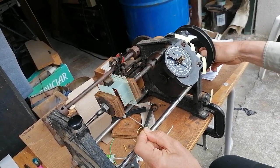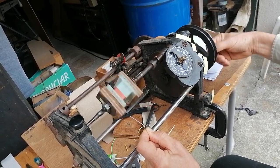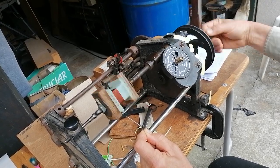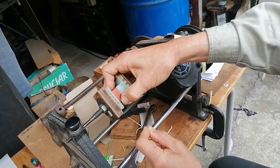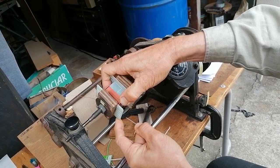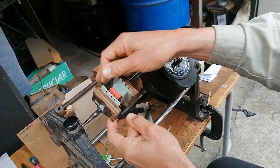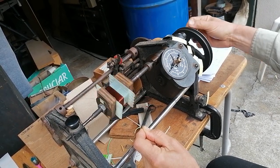The idea is to roll it so that there's no wires crossing over each other and that the windings are nice and neat, tightly fitting snugly against each other. It's easy to move them up with a thumb without overdoing it, just to remove any gaps between successive rolls.